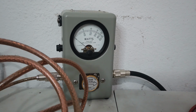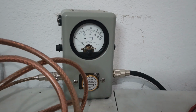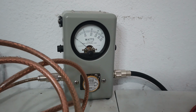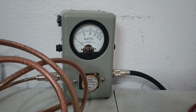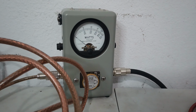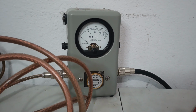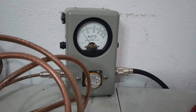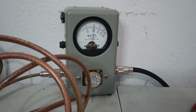That's getting us down there about a 10 watt dead key. Audio. Still about 40 average. And all the way down to basically nothing, very low. Audio. Still about 30 average. Whistling about 35. Audio. And it looks like it'll audio about 30. Now, if we want to go to PEP and see how much peak it's doing. Hello, audio, 1, 2, 3. A little bit over 100.